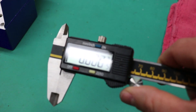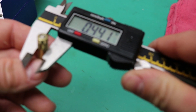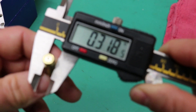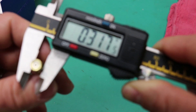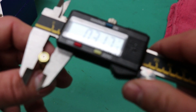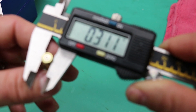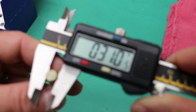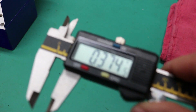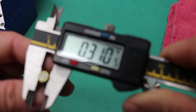As far as fired case dimensions go, in some of the hotter ammo I typically see the brass in the 5.7 grow to about 3.18, right about there. It grows a little more towards the bottom — 3.19, and a couple were at 3.20. Now as I mentioned, there were internal improvements to this brass, so down towards the unsupported part of the brass from the chamber, it almost hasn't grown at all. That's 3.10 — the factory is 3.12. A couple I even measured at 3.07 or 3.08.